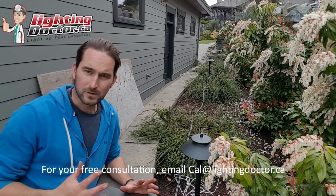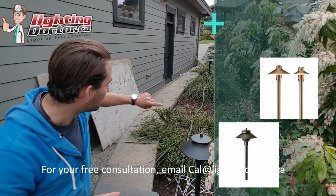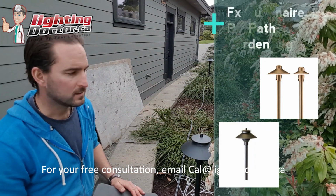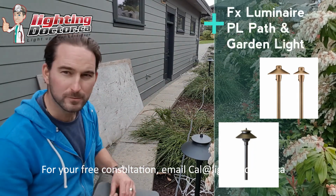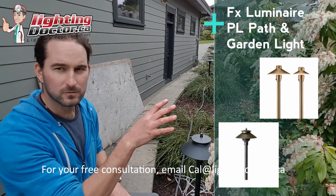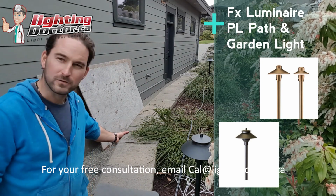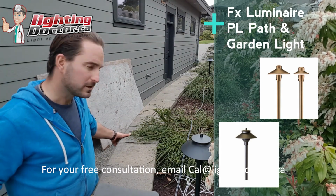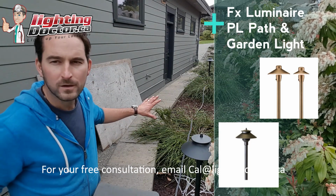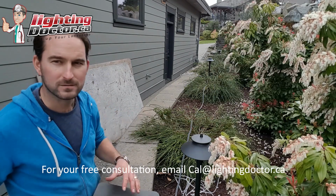Okay, so the final light that we've chosen in this project is we're using some path lights. So you can see along me there's a few of them, but we've got them spread out pretty sparsely. I mean, they're roughly about 15 feet. That'll cast lots of light because what we're using this for is we have a nice retaining rock wall here, and usually I like to use an undercap light, but because this has already been built and this is kind of an afterthought, without having to rip up the rock wall, we got to find a different way to do that. So we're going to use some path lights to do 2 things.